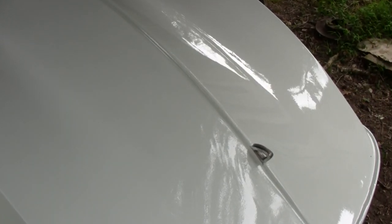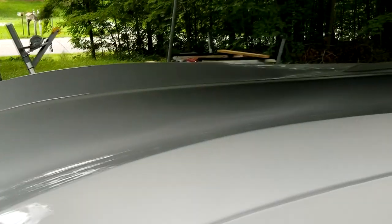Here's what the final coat looks like - about two hours after finishing the paint. The paint's settling down really, really nice. It's flattened out, and it kept settling down and getting even flatter and shinier until the next day. I'm really happy with the results. This is the fourth coat of Interlux Perfection, and I'm not going to go for a fifth. Interlux is correct - you can roll Perfection on the lighter colors and get close to a spray-like finish.